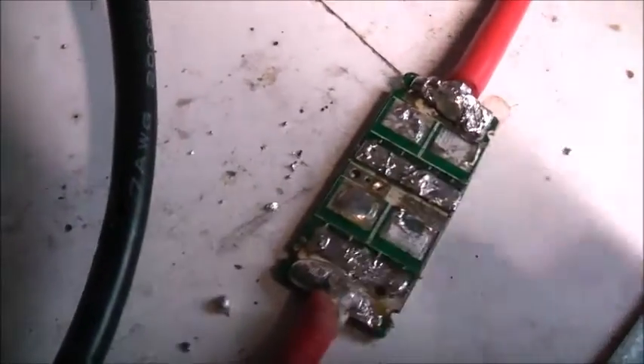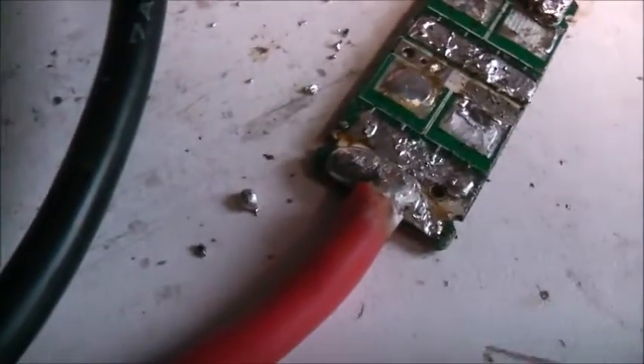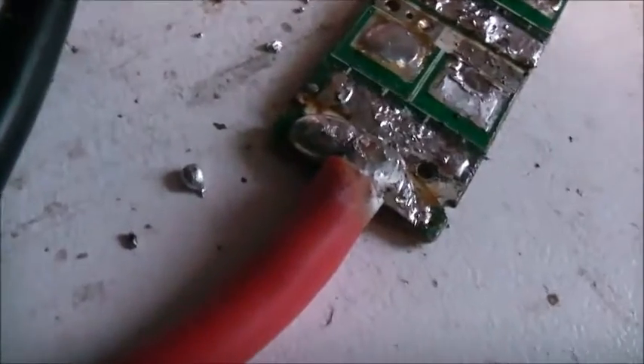Yeah, it is too - this one's on the same trace. That's not so bad. I can just solder that and bridge it to the top of the Schottky diode. Man, that was a mission. I destroyed one - melted all the plastic off and exposed the die. Wow.